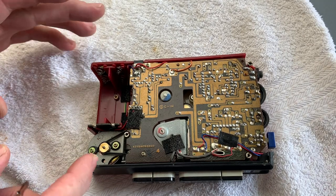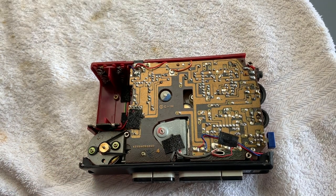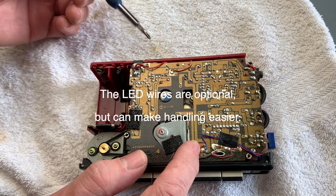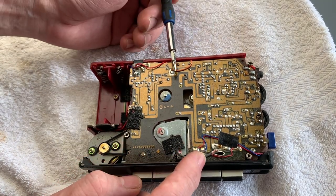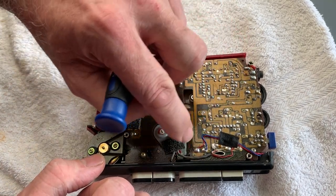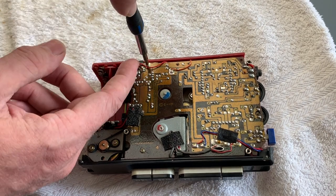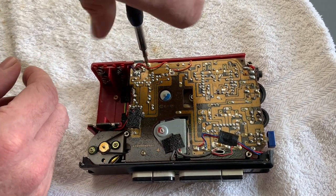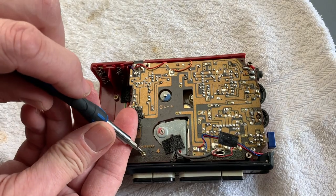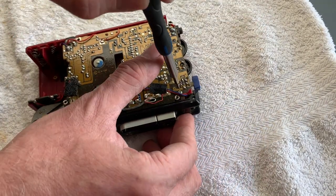To get to the rest of this we'll need to remove the shield - just changing the screwdriver. That screw is again tiny and a different colour, so keep that one aside. The shield is off, and now I like to employ the soldering iron technique for this one - it's much easier and quicker to get in. So we take the light cables: the blue and red, then the orange and red, then the battery supply red and blue - that's about seven wires. We also need to unscrew the board - three screws with tiny little washers.